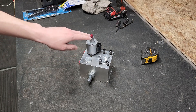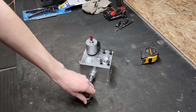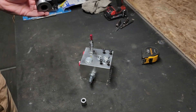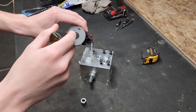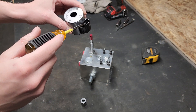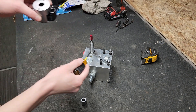If you press go on the pump but the PWM isn't running, take the nut off and remove the solenoid. Inside the solenoid is a black polymer coil that will magnetize. While the PWM is still plugged in and you hit your master switch on, grab a screwdriver, stick it in, and feel if it's magnetizing. If you don't feel it magnetizing, you're probably not getting voltage to the solenoid — take off the PWM plug, put a voltmeter in it, and check for voltage on the PWM line. If you do feel it magnetizing, the solenoid is getting the voltage it needs and should be pulling the stem up.